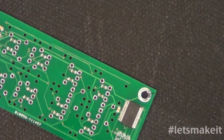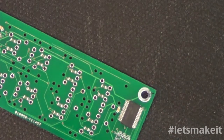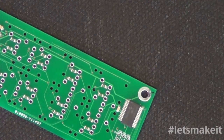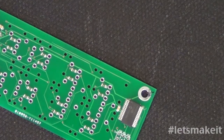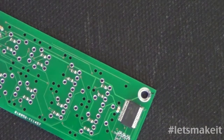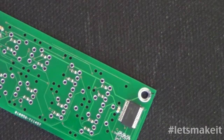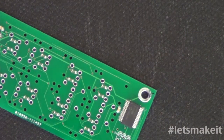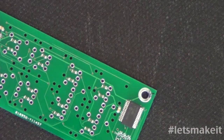So I'm going to go ahead and plug in the griddle. I do unplug it every time just to be safe. And then I'm going to turn it on right now for about 250 degrees, because if you look at reflow, they generally tell you to heat it up before you go up to that level. That allows everything to flow evenly.